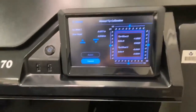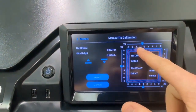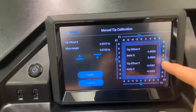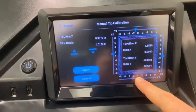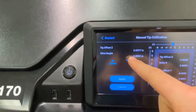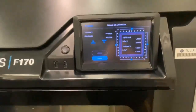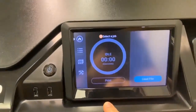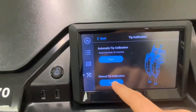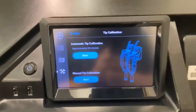Once we've taken our measurements from the calibration part, we can come over to the touchscreen and use our sliding scale to adjust the location where the support material is most centered along those two model lines. We can then change our Z height using these arrows and click Apply. We're going to close this, and just to confirm, we're going to print another calibration box — going back to tip calibration and doing another manual tip cal — to verify that our calibration is correct. Then we can start printing.